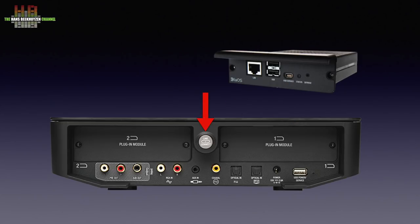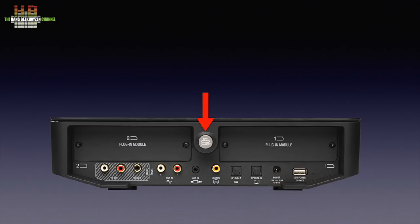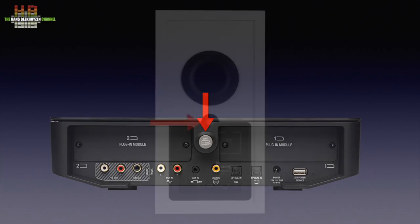The Sound Hub connects to the speakers over radio waves carrying the I2S signal at up to 96kHz sampling, completely lossless. Pairing is straightforward: press the pairing button on the Sound Hub, then sequentially press the link button on each Callisto and wait a few seconds. The Sound Hub automatically switches on and selects the active input when a source is playing, as long as unused sources are switched off. The only exception is the mini jack, which has no auto-sensing.